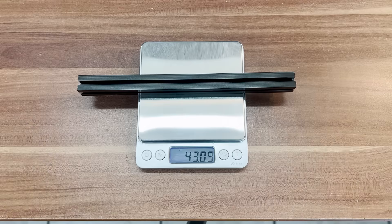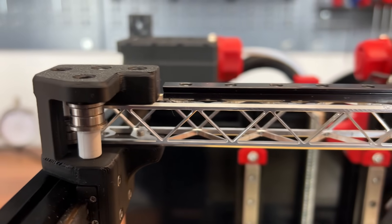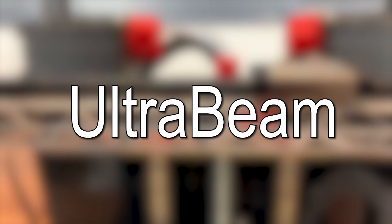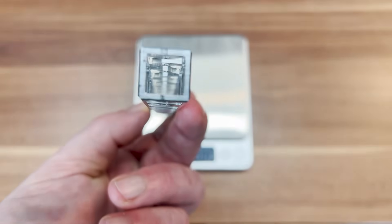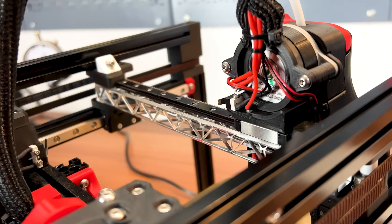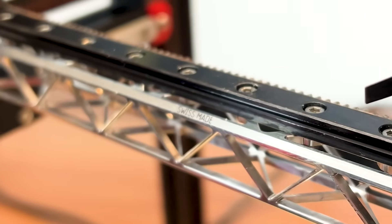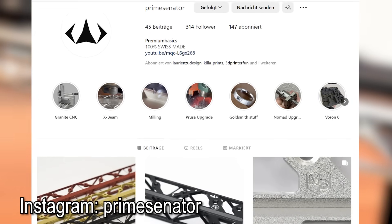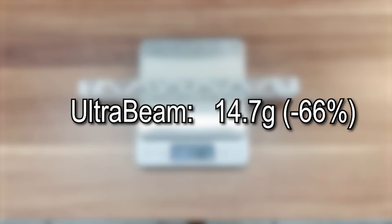The weight of the 15x15 extrusion at 200mm length is around 43 grams. The Ultralight X-Beam, designed by PremiumBasics and tested by YouTuber PhilFast, is meant to boost the speed capabilities of a Voron 0 by going lightweight for the X-axis. I'll call it the UltraBeam throughout the video. The approach: a square aluminum hollow profile with 2mm wall thickness as raw material, CNC machined to a minimum. The finish looks very nice and the stated tolerances are within the range expected for 3D printing applications. It's Swiss made. I bought my sample directly from PremiumBasics — on my scale, the beam weighs around 14.7 grams, that's 66% lighter than the default beam.